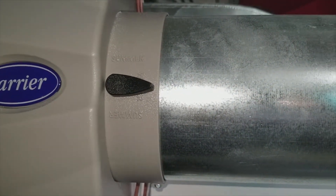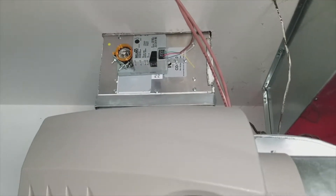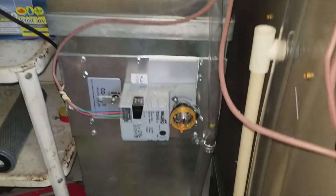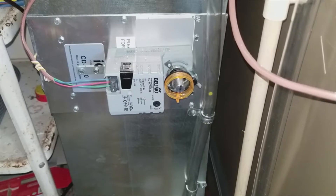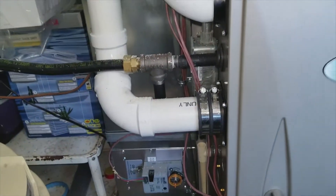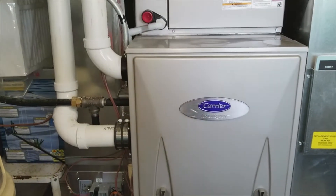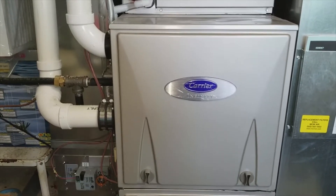We're still set on winter mode and will be changing over to summer coming up. The BLEEMO valve has been working fantastic. Right now the upper zone is in the closed state — no air flowing upstairs — and we're only needing heat in the downstairs part, so the downstairs valve is open 100%. I have the system set so the BLEEMO valves are constantly moving air through the house — low on the upstairs and higher on the downstairs.